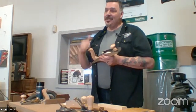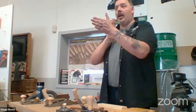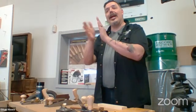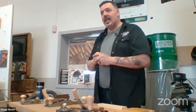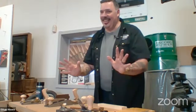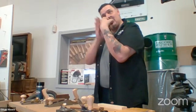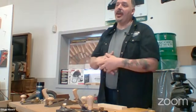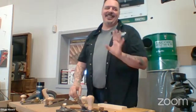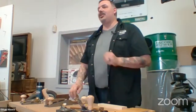A lot of times you can get away with planing against the grain. Or if you're working with a material like rosewood that has what's called rowed grain — or sapele — on one stripe the grain is coming towards you, and the stripe next to it is going away. So how do you hand plane that? You pick a higher angle — or a sander. Because at some point it's going to be like, this isn't working, and you go to your flat master and do your surface prep that way.